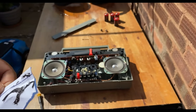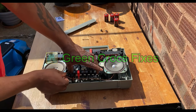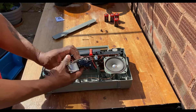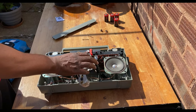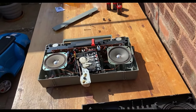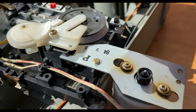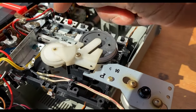So what I'm gonna do is pop the screws out for the tape mechanism and just pop that back out again, turn it the other way around so I want access to fit the belt. I'll zoom in a bit to give you a closer look of what I'm doing. This is the assembly for the cassette - that's the motor on the right-hand side, the pulley is free, and that's the pulley for the capstan. And then this other pulley here controls the rewind and fast forward.